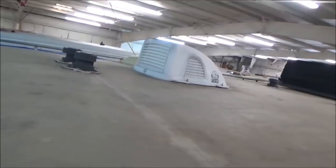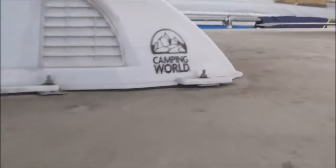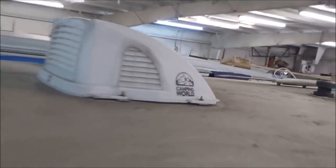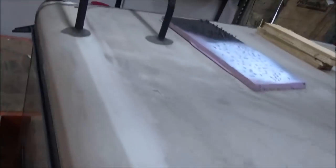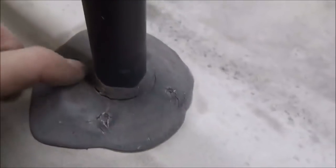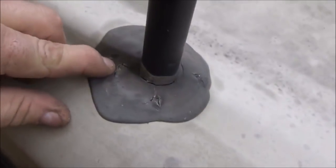We've got a lot of bruising on here — we'll have to get those covers off. We may have to take a disc grinder and grind that right off, or even cut it out and heat weld another piece in. Some of these areas are really problematic — see how that cracking is right there? They're going to want you to go back and put more on, more on, more on. The only ones who keep putting more on are morons.